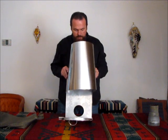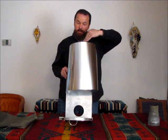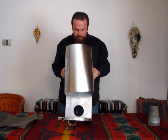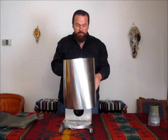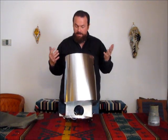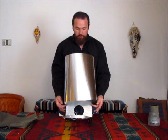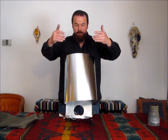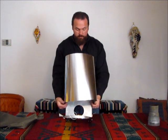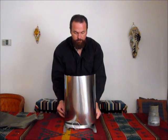Now what I'm really being careful of, it's going to want to ride up out of the groove a little bit, like this, and when I'm putting this on, I have to be very careful about that not happening. Now, with this setup, it's working just fine for me to push down from on top. Sometimes maybe it gets dirty and doesn't work as well. What's a little bit more reliable is to reach underneath like this. I'm pushing in to keep this seated firmly in the groove and pulling down until I get to the bottom.